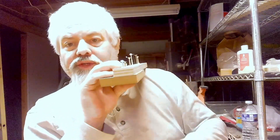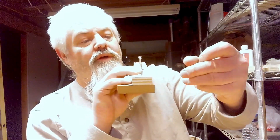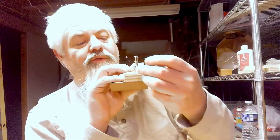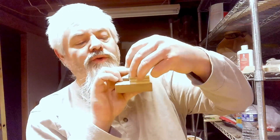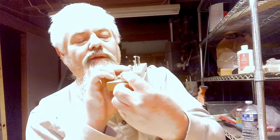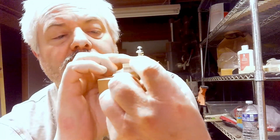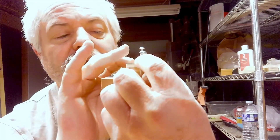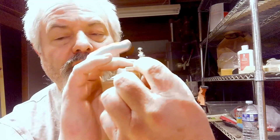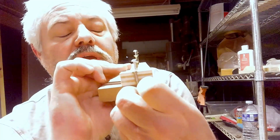This is really basic, but it'll give you an idea of what I mean. So here you have two pieces of wood that you want to join together. If you look at this screw, you can see that with the top part of the threads gone, when you drive this through, it's going to look like this. And you can see it doesn't have very many threads in the top board as opposed to the bottom board.